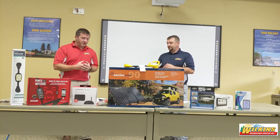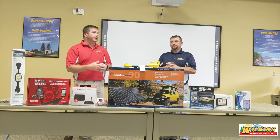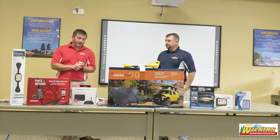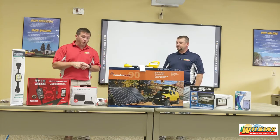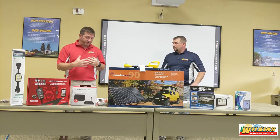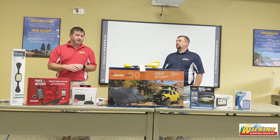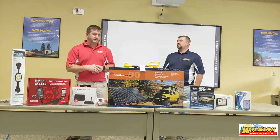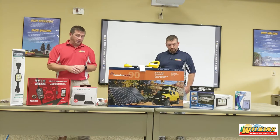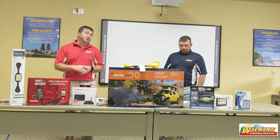First, recognizing what type of battery you have. The most common battery in a trailer or towable camper is a 12-volt battery — one battery typically wired positive and negative. If you have two 12-volt batteries, they're typically wired in parallel, keeping your 12-volt source but giving a larger supply of amperage — longer lasting. If you're doing a lot of dry camping, that's an optional way to go.